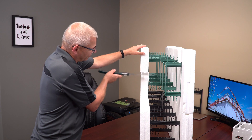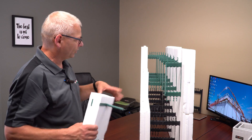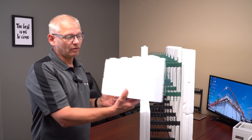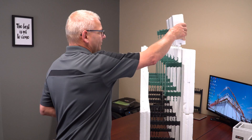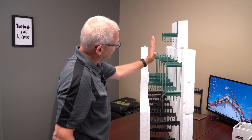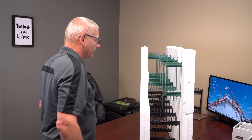You would cut down as far as you need and take that off. We can't really make the curb for you because there's so many different options. Now, these cutoffs — you can run them through the table saw. On this job I was just on, they did that, and then you clip that onto the top, and you could go as high as you want at that point and screw the plywood on, attach at the top, and pour concrete. That's one other option.